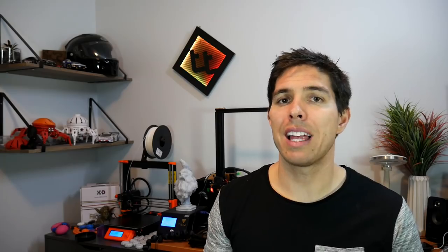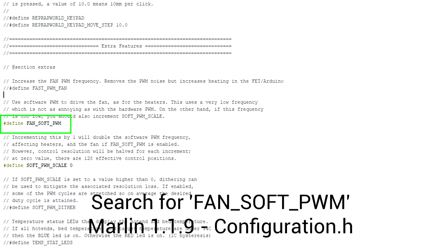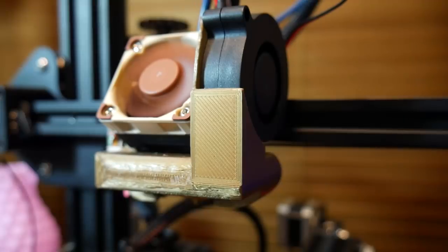We know how to step down the maximum voltage delivered to the part cooling fan — I'm using a 12-volt fan here. The real noise comes from PWM whine when you run the fan at lower voltages, for instance if you don't want it blowing at maximum capacity. Fortunately, there's an easy fix in the firmware: simply search for and uncomment FAN_SOFT_PWM in configuration.h. I've also read that you can wire in a capacitor in parallel to smooth out the PWM signal and further reduce the whine, but my results didn't show that it made any real difference.